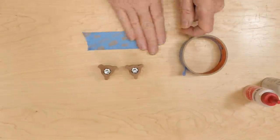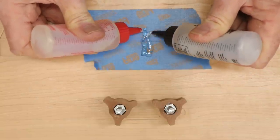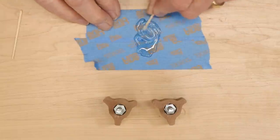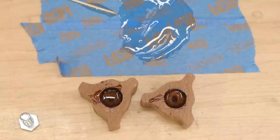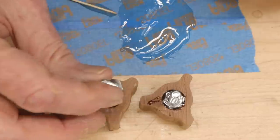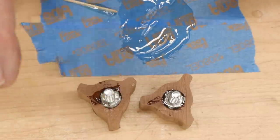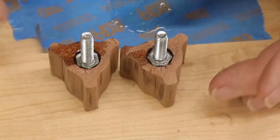In the past, I've often chiseled out hexagonal holes to fit the bolt heads exactly. However, this situation did not demand maximum strength, and my experience is that 5-minute epoxy will hold this size bolt in a round hole without any difficulty. If I had, say, 5-inch diameter knobs and really had to tighten the bolts against heavy resistance, I would probably choose to fit the bolt heads into the wood.